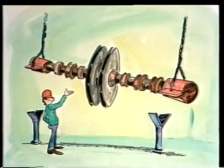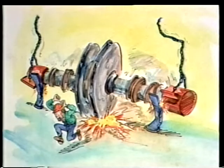When overhauling large pumps, be certain that the V-blocks you use can support the rotor. Otherwise, V-blocks could break, dropping the rotor on the floor.